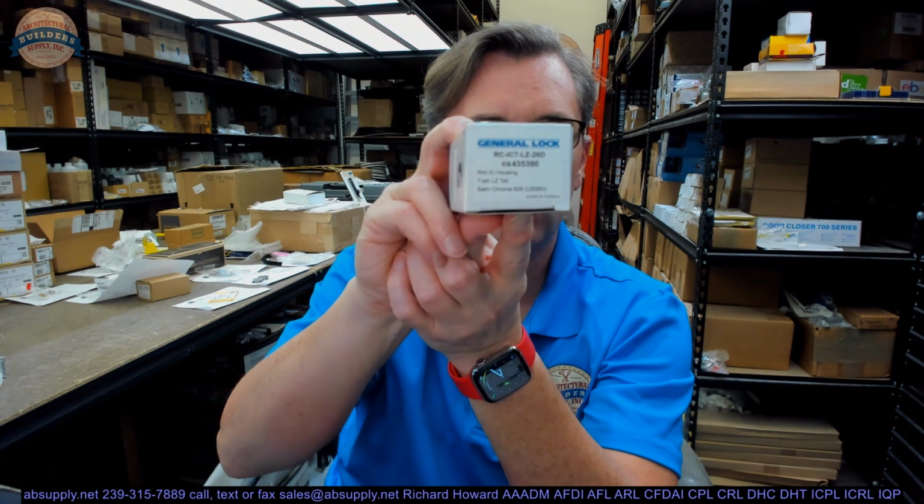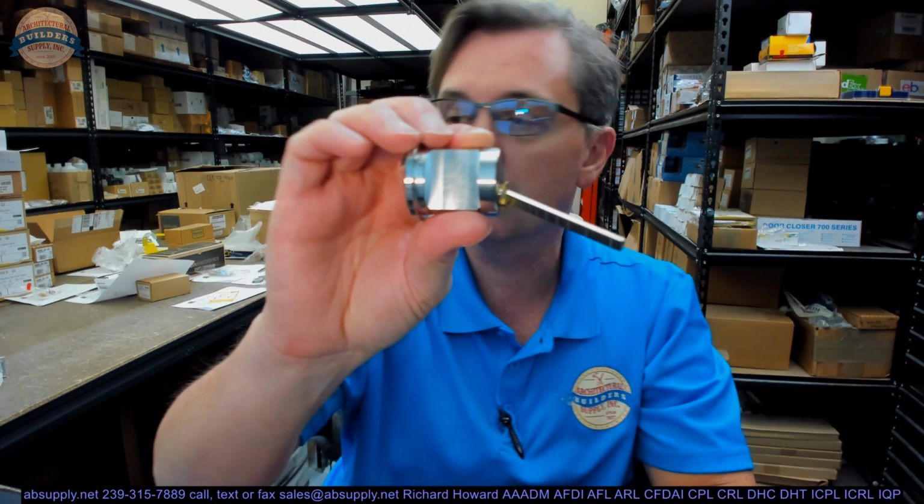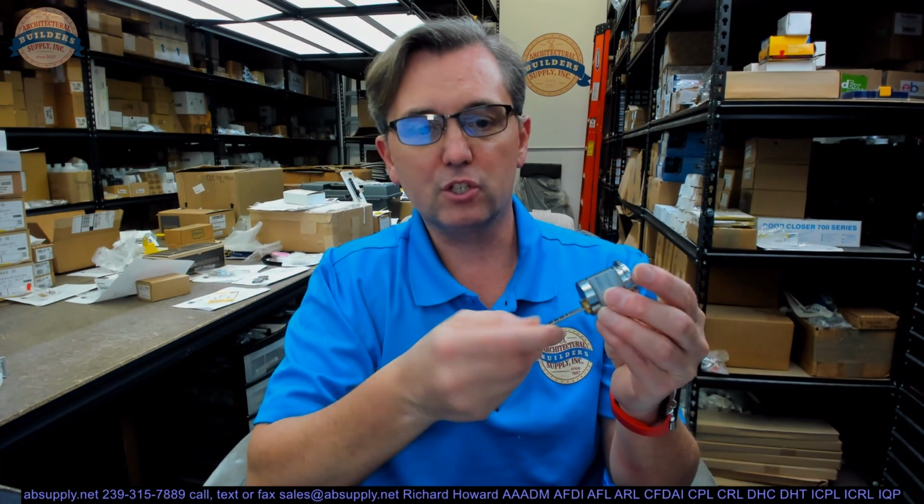This video is to bring you a closer look at this, the General. Their part number is RC-IC7-LZ26D. This is a rim cylinder. Pretty easy part number: RC, rim cylinder. IC7, it's an interchangeable core 7-pin. It's an LZ, which means it's a lazy action. It's a lazy cylinder. We'll discuss what that means.